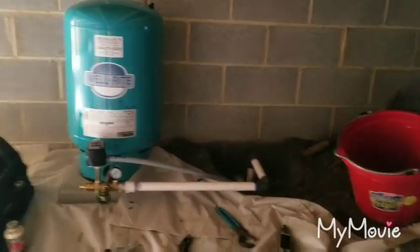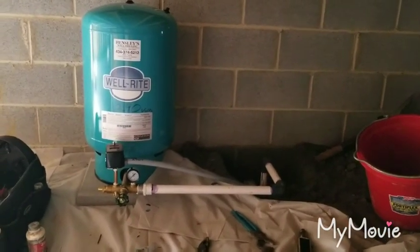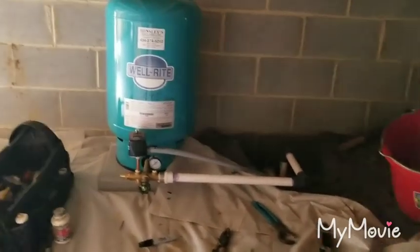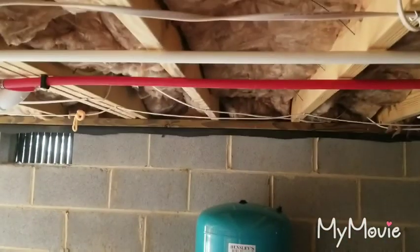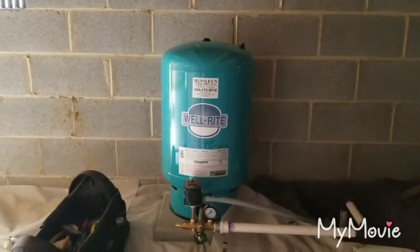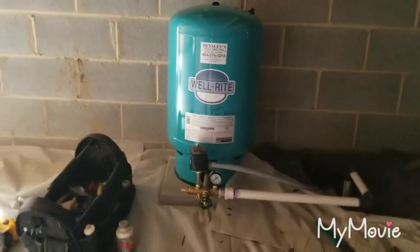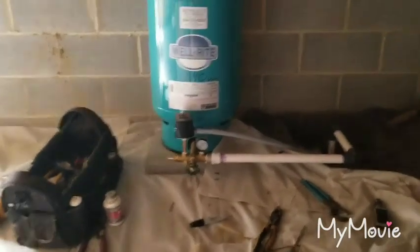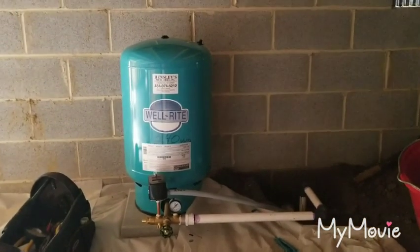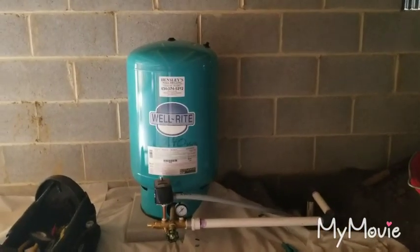That's basically what we've got — gives you kind of an overview of it, nice and professional. We have to cover the hole in, but the inspector wants it all open so he can look down in there and make sure we've sealed the hole. The electrician has to come mount a disconnect box either in the floor joists or on the wall — it'll be a 240 volt pull-style disconnect and it'll come straight from that and go to the other side of the pressure switch. That's his responsibility. Well, thank y'all for watching — hopefully this video helped some of y'all. If you have any questions feel free to comment, I'll be able to answer them. Thank you for watching and subscribe.